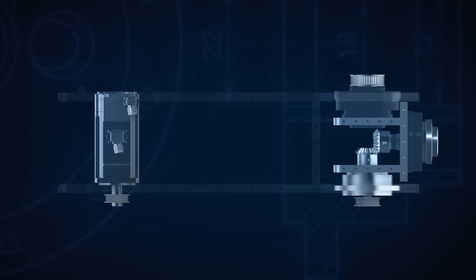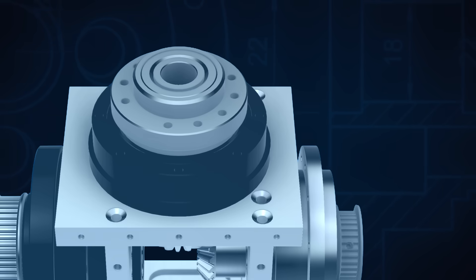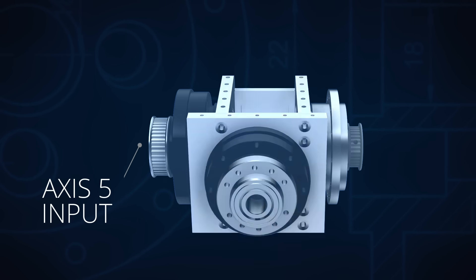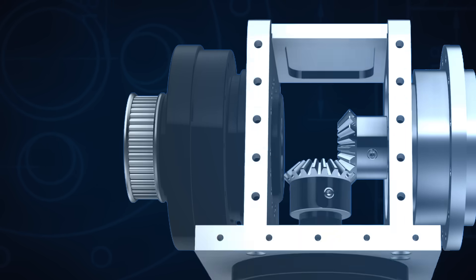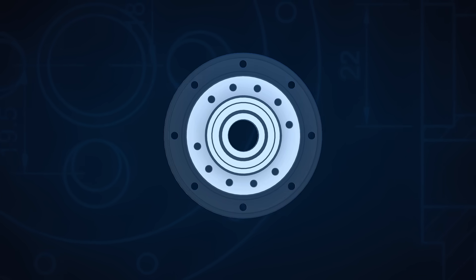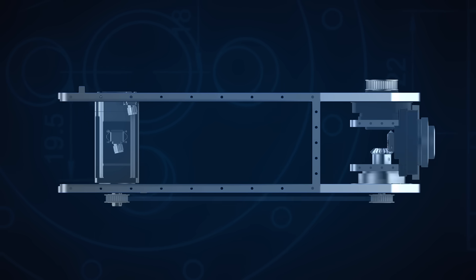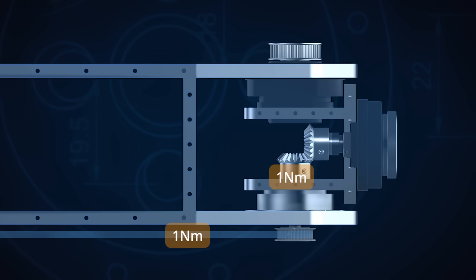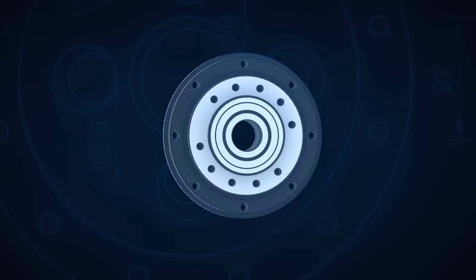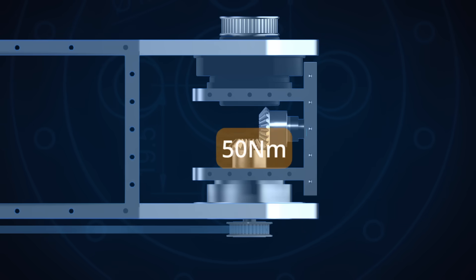Motors are big and heavy, so they are going to live further down the forearm. For Axis 6, motor power will travel up a belt to a pulley, which drives a set of miter gears, which in turn drives the 50 to 1 harmonic drive gearbox. Axis 5 is a little simpler, with motor power coming up the forearm to a pulley driving the input side of a larger 50 to 1 gearbox. The pivot itself is direct mounted to the output of this gearbox. Gearboxes are also fairly big and heavy — so why aren't those down in the forearm as well? With the gearbox being the last link in the chain, all other powertrain components are on the input side, which means they only deal with the torque the motor can output. But if we put those same components on the output side of this 50 to 1 gearbox, they'd be experiencing approximately 50 times the torque. So they would fail.